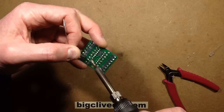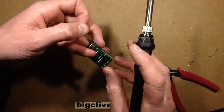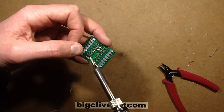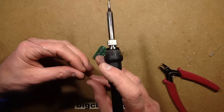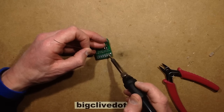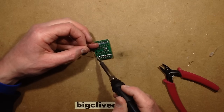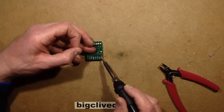I've got a larger bit on this at the moment — I prefer a larger chisel tip. I'm going to flood solder onto these pads — these are general connection pads. When I designed this I went for the biggest pads I could fit in, because it does make it so much easier to tack the wires on, particularly if you're working in a cramped area. Sometimes I had to put LEDs and stuff into existing sets that were already built, and they hadn't really thought too much about access for the electronics.